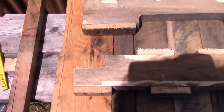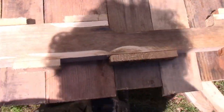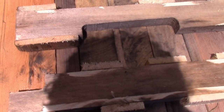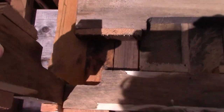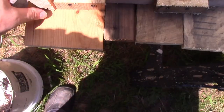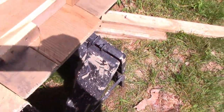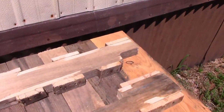You're basically fence building. I used the leftover braces from the pallets and ran them all the way across. Then I staggered the boards from different pallets just to give it a better look — it's kind of more random. This is the measurement of one of the pieces of the pallets that's left, a cut-off here, but you're going to use it to measure your adjoining pallet and the wall. So you want to leave space on the ends for that. You kind of start on the ends, and I've got to cut this section off where I put a line. The bottom is a little jagged too — I'll probably just take a skill saw and knock all that down to one level. Then I'll join four of these together.